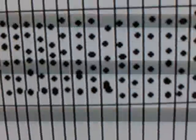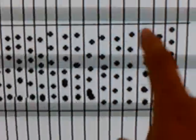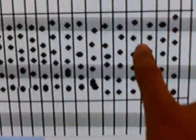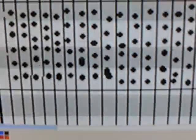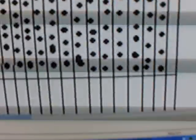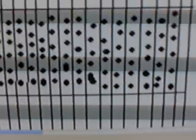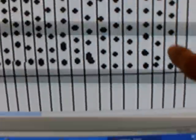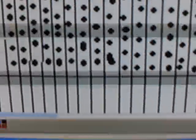If there's any current leakage at all, it's going to come out through my holes and through the electrolyte — it won't be coming from the plate edge because the plate edge is going to be sealed. Every single one of those holes — that neoprene gasket I plan on putting on the plate — each one of those holes will be all that's cut out of the neoprene gasket.